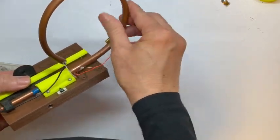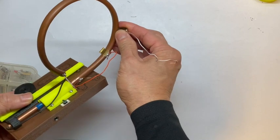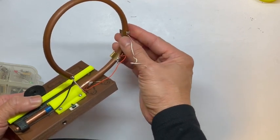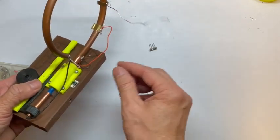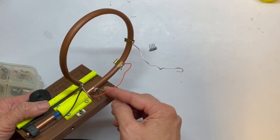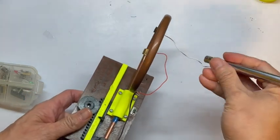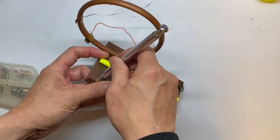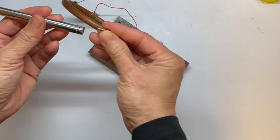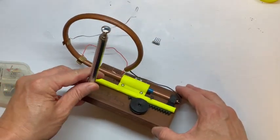And then there's another clip that you can use to hook up your antenna. You can use a long wire around 1.5 meters or a Yagi antenna like what I did. I just need to connect one end of the Yagi antenna to this spot or to this spot, depending on which one gives you the best impedance matching for the station you are tuning. Alternatively, when you are working outside, you can connect this end to a telescopic antenna. Using an M4 screw you can mount it to the base of this unit and then test it outside.